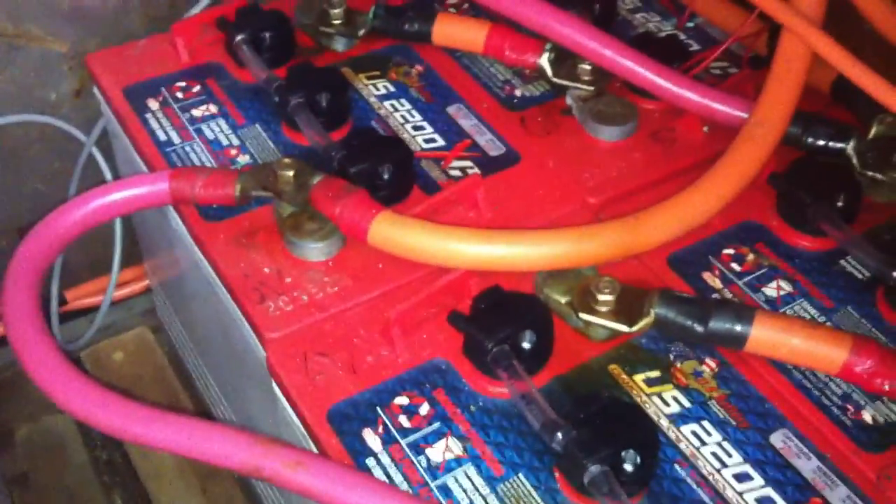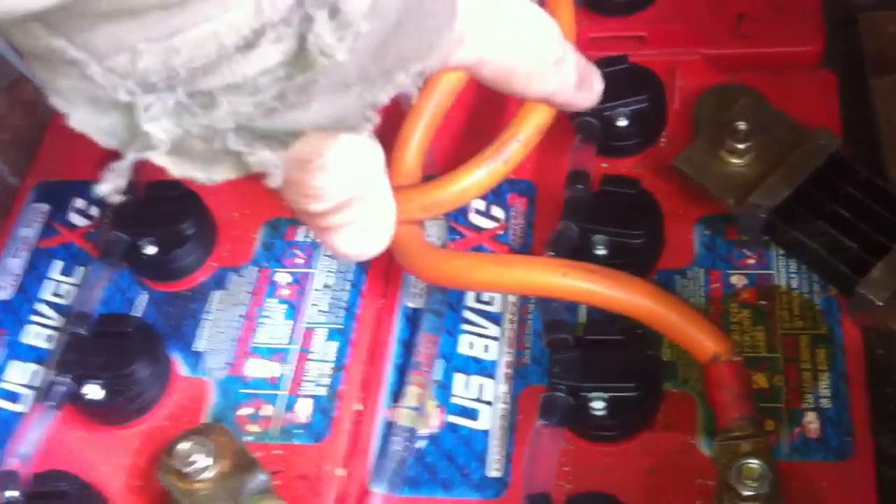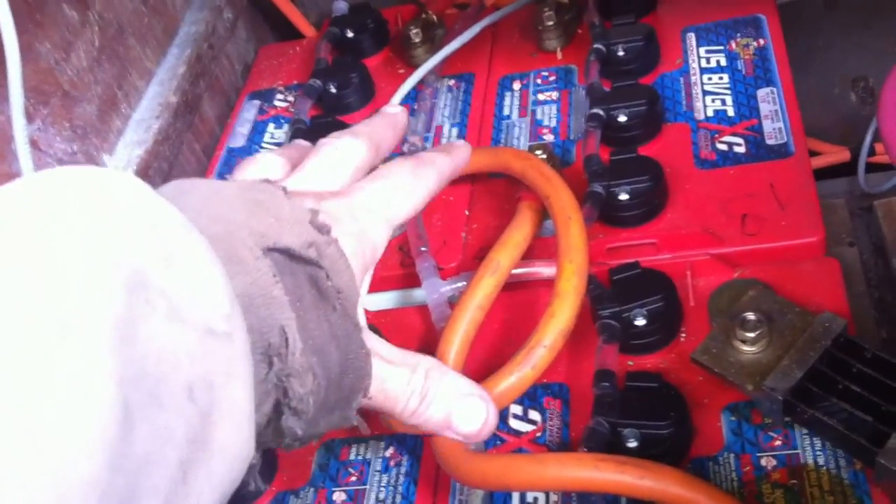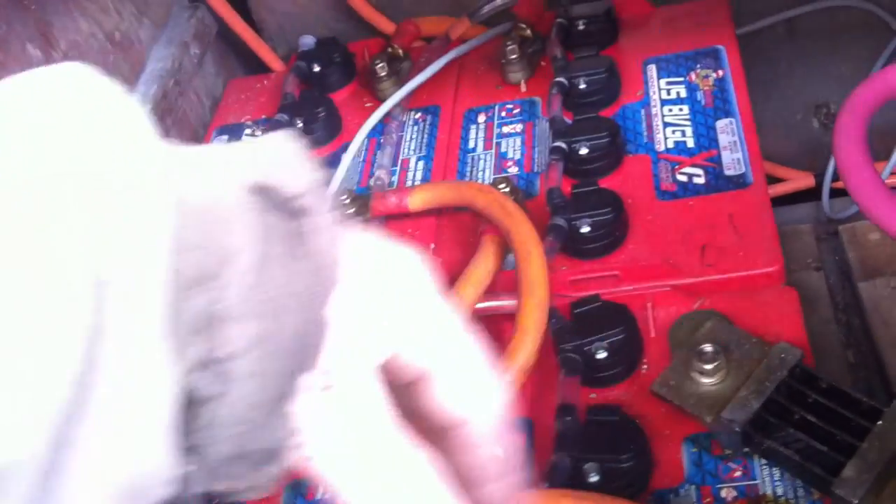There are these little white markers — here's how it works. Down here I've got this end and it's a plastic water line, low pressure. It comes up to a tee — got the tee here — so one line comes over here and feeds these eight cells, and then from this tee it comes around and feeds these other eight cells. This is one battery bank because it's four 8-volts in series making 32 volts.